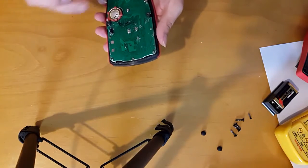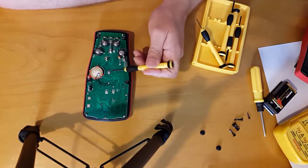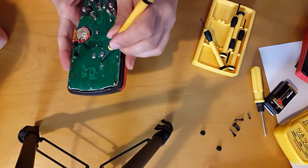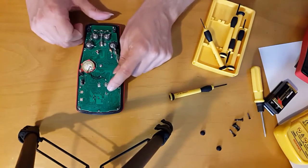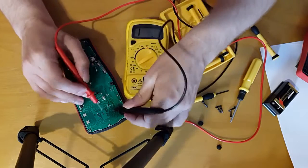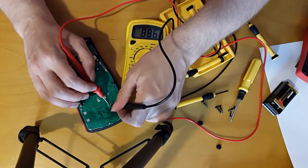Let's just have a look in there. That one's obviously going to be holding the central column for this, so I want to unscrew these. The first thing I've noticed, before I'm even in there — and this was a brand new meter which I'd not opened — is that all of these screw heads, or many of these screw heads, look pretty worn. The other thing I'm going to notice is this whole component doesn't look quite right. R85 suggests it's going to be a resistor, and there's this stuff around it. I can't read what's on top of it. What do you think we can do with a resistor we don't know what it is and can't read? How can we find out a bit more information about it? Multimeter. I'm going to try measuring this in a 20k range — nothing here. So I'll go up a range, try something in a 200k range. Nope. 2 meg range? We have something Helena — we've got around about 881k.